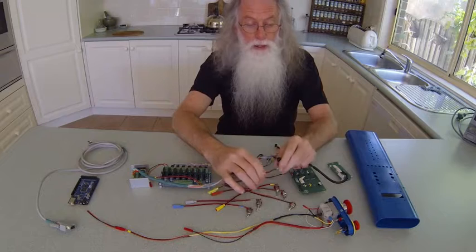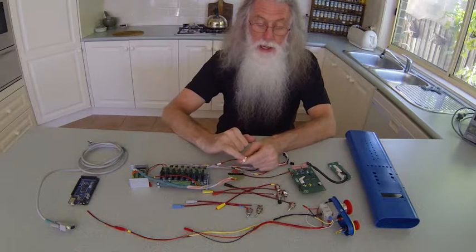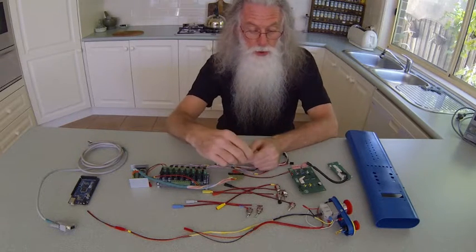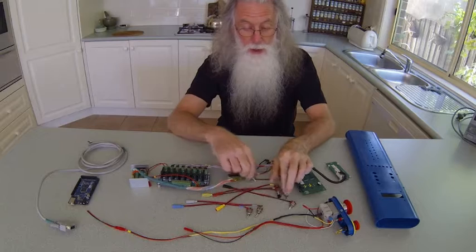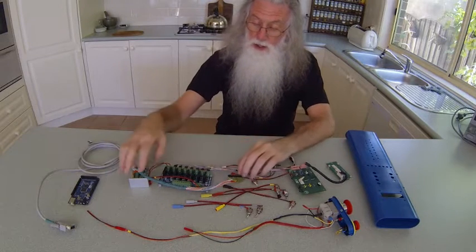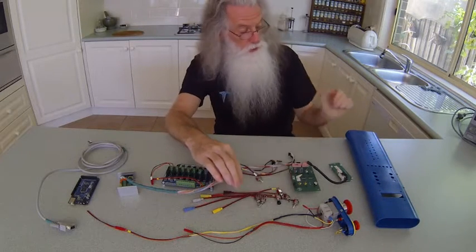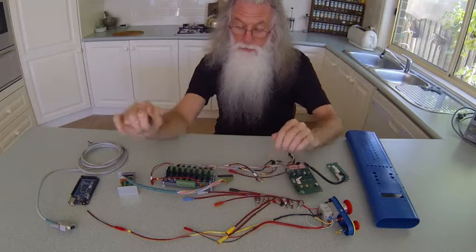So this particular one here, wired to the relay board, will be the button that manually releases the collet from the automatic tool changer, because that will be controlled by the Arduino. I don't want to accidentally knock that while the machine's working, so there'll be a safety cover on it and in between the other two buttons, so I will have to purposely press that button for it to release. That's if I want to do manual tool changes, that sort of thing. So the wiring then will go out of the bottom of the tube, which is open right at the top, and through a recess into the table RHS, the 2-inch RHS, and the different connectors will go on there.